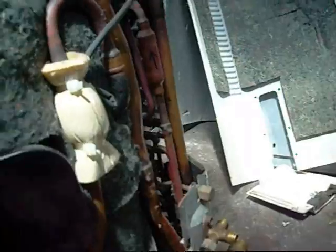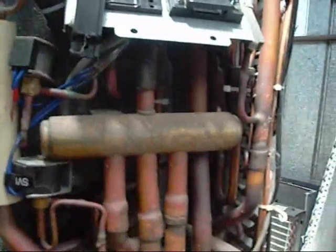There's a tube going out by the looks of it. I'll have to pull this off and try and uncover it. We've got three solenoid valves going between the liquid line and high pressure out. For some reason they've got solenoids to dump from high pressure to low pressure, and there are three of them. That's probably one of the little tricks in R410A systems. It's got an arrow on it — liquid line out that way, meaning in heat pump mode it returns liquid that way, and in cooling mode liquid goes out through there.